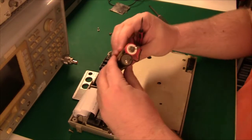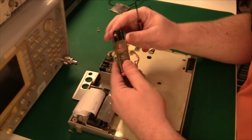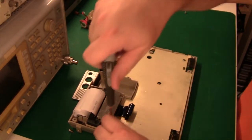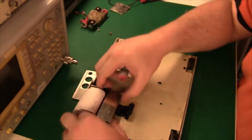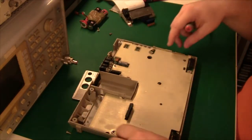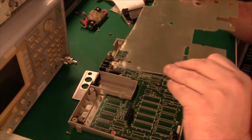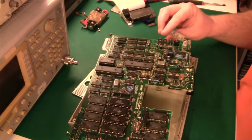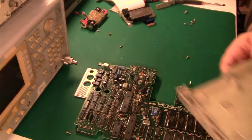I will do that to all the machines that I have and redo these — 1800 milliamp-hour nickel cadmium. Now the main PCBs are in the back part, so we need to remove the screws to get it off. There's a screen here for EMC suppression — it's conductive aluminium at the back. And we got it out. This is the machine itself — this is called the MOSU board, the real Japanese name. This is the main PCB.